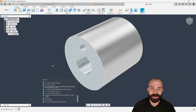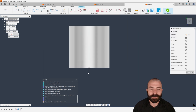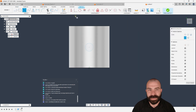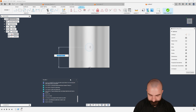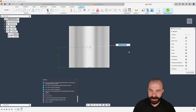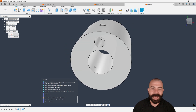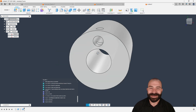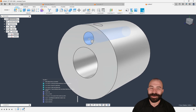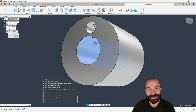So there we go. We have our couple of holes here. Now we're going to kick that off and create a brand new sketch at a different view. This hole is going to be my intersect hole. We'll go horizontal, vertical, distance off the end — go three. And let's make this maybe a 0.75 hole. I'm actually creating both scenarios all in one shot: I have a cross hole off center for the lathe, and I also have a cross hole based on center of rotation.